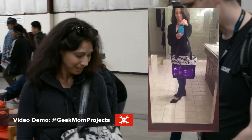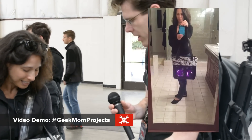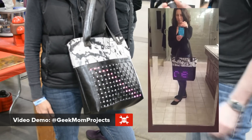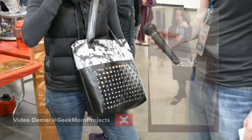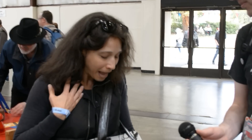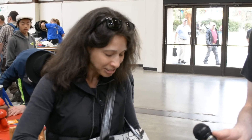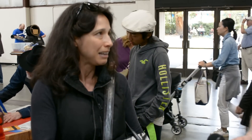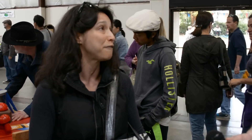I love the spacing of this. You have leather that's been woven and in between the nodes are where the LEDs came through. How did you make that spacing work so well? I'm very interested in wearables that don't look like wearables. I hate it when it looks like you just slapped a circuit board on top of a t-shirt, so I laid out the matrix first, cut the strips to fit in between, and wove it directly on top and glued the matrix together. Then when I sewed it, I took the matrix off, sewed the purse, and then stuck it back in and it fits nicely.